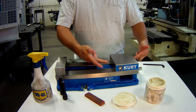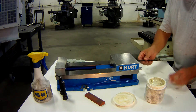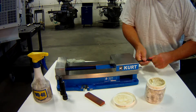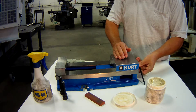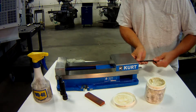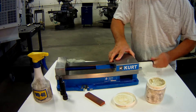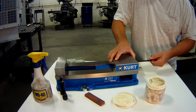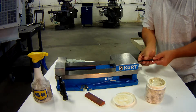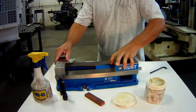As you take up the lash, there's a set screw that pushes against the back — there's already one in there as a backup screw. I turn this set screw — it's a quarter-inch set screw — and tighten it to take that lash out, so now there's no lash in there. Then I follow that up with a jam set screw to hold it in place.